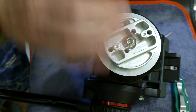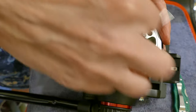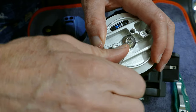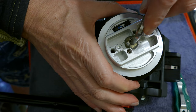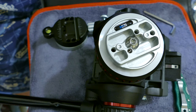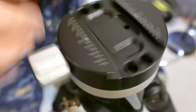I'll show in this clip me putting in the cone point screw, which is the same thing I did on the other one. There are four threaded receivers there — I put it right next to the 3/8 just so it won't have a tendency to lift the plate away from the fluid head. I put it in that threaded area and torque it down nice. Don't over-torque it, but that is going to make sure there's just no way it's going to twist on you when you're putting some torque on that fluid head.